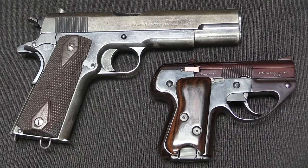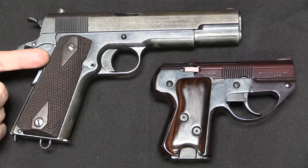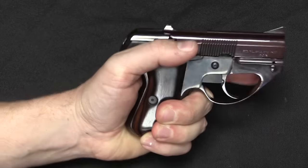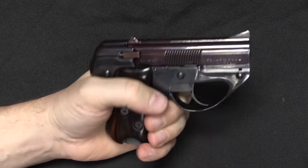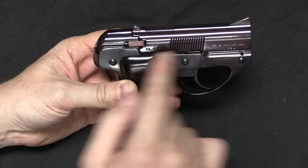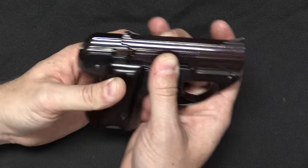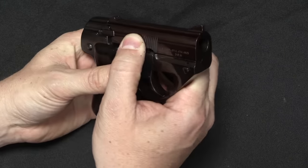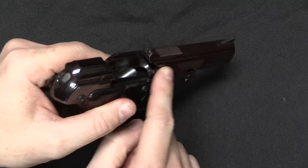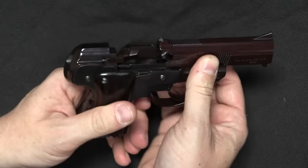Just to give you a size comparison, here is the LM4 alongside a Colt 1910, which is the same size as a 1911. You can see that in the hand this is a pretty compact pistol. Part of the reason they're able to make it very small is because they don't have to leave any space for a recoil spring or a recoil system. This is manually operated, and the slide actually moves forward - the barrel is integral to the slide, it's not really a slide so much because it doesn't have a recoil spring.